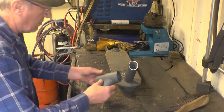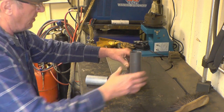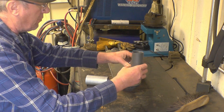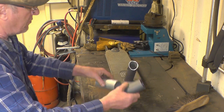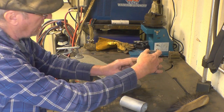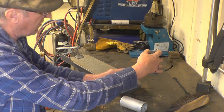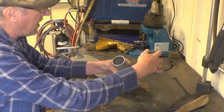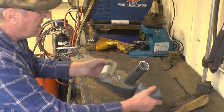I've got a frame here of one of those horrible little electric scooters. The lads actually managed to crash it and break the headstock off clean through. So I've got the pieces back together, but it's no good simply putting a weld around there because it'll be a weak point. I've got some aluminium tube, so I think what I'll do is weld that on and make some fillet plates to go around the sides. Leave the top and bottom open but just put fillet plates around the sides. Obviously I've got to put those holes in there — some wires go through there. I'll put an aluminium tube there, slightly heavier wall. That's oval and this is round, so I can squash that to get it somewhere near the right shape.